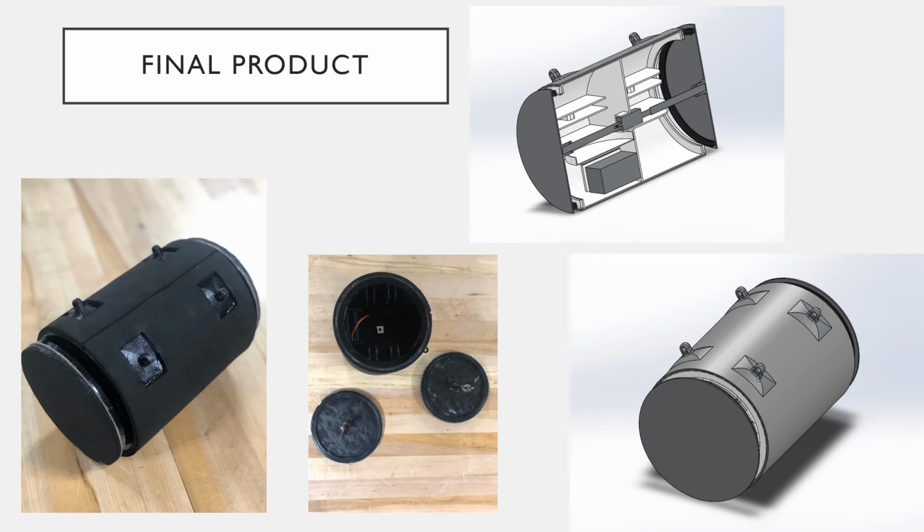In our final product, there were slots for 4 petri dishes, 2 dishes for each sample. The actuator was controlled by a pressure sensor, which was programmed to output a voltage in correlation to the change in altitude with one side open at all times. The control sample will initially start in the open position and switch to close at 40,000 meters.